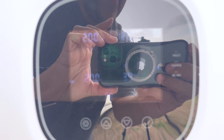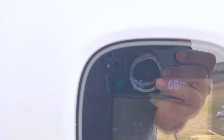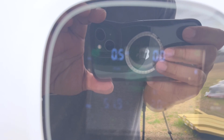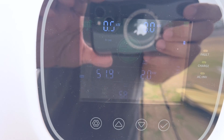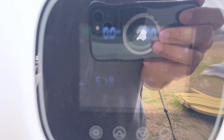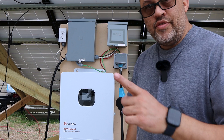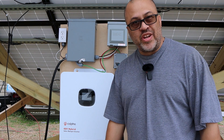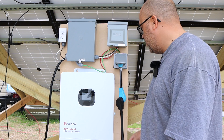Got 3.9 kilowatts coming out. Let's see how much solar we've got coming in — it's kind of cloudy out here today, so I'm only getting 500 watts coming in from solar. Each one of those legs has about 2 kilowatts coming out, so right now it's working: 4 kilowatts — 3.9 kilowatts — no problem. The thing is pretty quiet too, just making a little bit of noise.